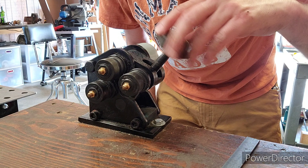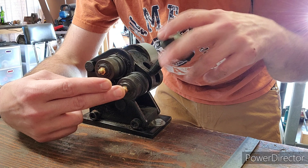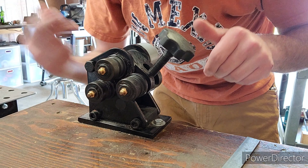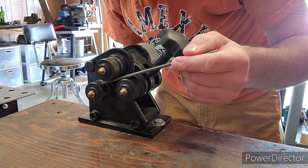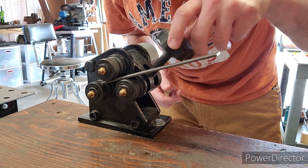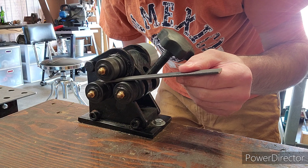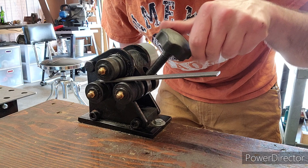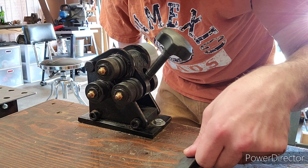The way this tool works is: the closer the distance between these two rings, the less your bend. So you can see here if I were to put this in now and crank this almost all the way down, you can see how that would pass through quite easily without producing much of a roll. Now if you increase this distance it does the opposite - it makes the roll greater.